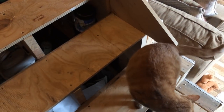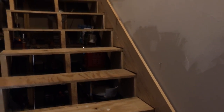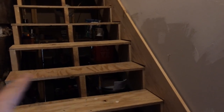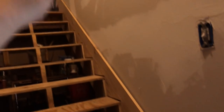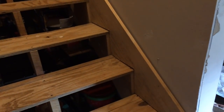Me and the cats got our skirt board laid up here and it fits pretty good. There are a few small cracks but that won't hurt anything — they'll be covered when I put the treads and risers up. I've scribed off level with the wall where I want it, same at the top. I'll take it out and cut that off and it'll be ready.